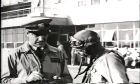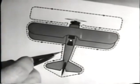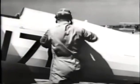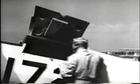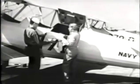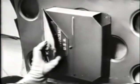After inspecting the left side of the tail assembly, proceed up the left side of the fuselage to the baggage compartment. You always open the baggage compartment. What you carry there varies with different stations and different types of planes. But you don't want to carry any unnecessary weight. And should the compartment accidentally come open in flight, you don't want dainty little items like wheel chocks spraying out over the landscape. Also, in some types of primary trainers, there should be a first aid kit in this container in the top of the baggage compartment. And be sure the compartment fasteners are secure.